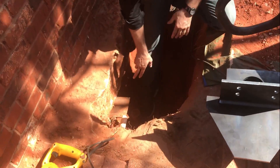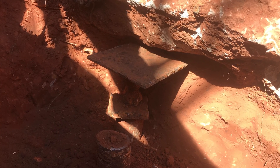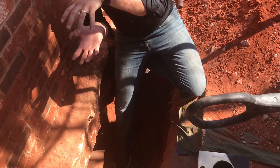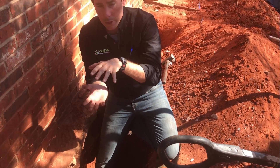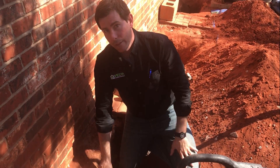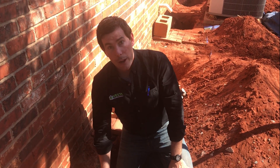If you look here closely, a concentric pier sits directly underneath the footing and is designed to be pushed into the ground with a small electric hydraulic pump. Unfortunately, it doesn't have enough space to drive the pier down deep enough to reach load-bearing strata or bedrock.